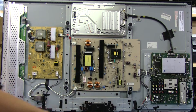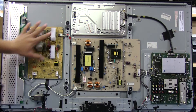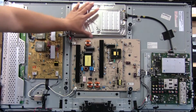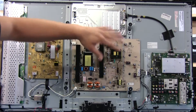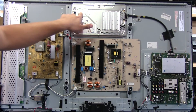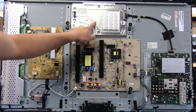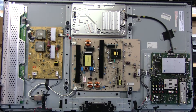Looking at the back of the TV, we've got our usual assortment of boards: the main power supply, the inverters and ballasts for the cold cathode tubes, the input board which I believe has the scaler, and here's the T-con board. This one's actually huge — I thought it was going to be small up at the top, but it's rather large with a big heat sink. There's a chip right there which is pretty much what we're going to be looking at.